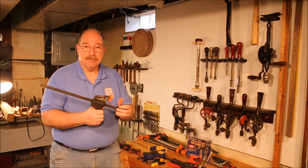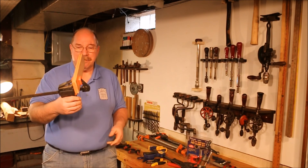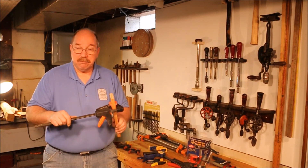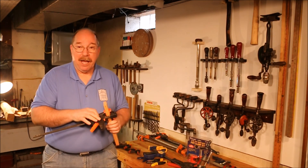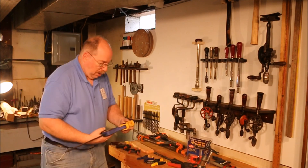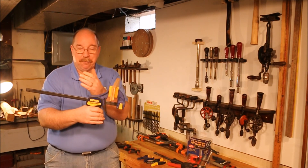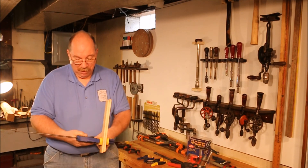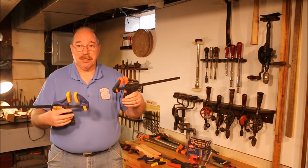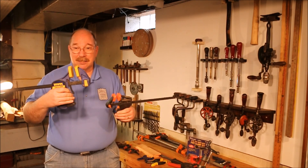If you're buying a clamp like this, keep in mind what you're using it for. If all you're doing is holding two pieces together while the glue sets and you're only putting that much pressure on it, it's probably a good deal — it'll hold the parts in place and you're probably not going to break that pin. But if you do anything more than that, you're going to break it. If you buy one like this Irwin, made of fiber reinforced plastic with a stronger mechanism and metal components, when you pull on it you're not going to break it. It'll cost two to three times as much, but if you're doing a heavy duty job and really need to pull hard, this is the one you want.